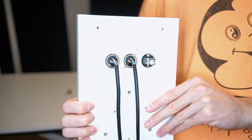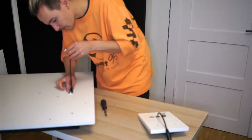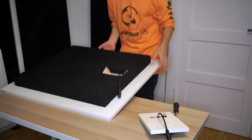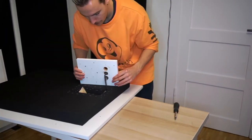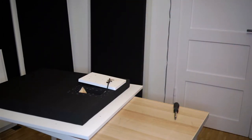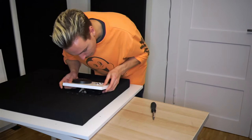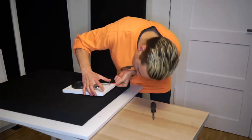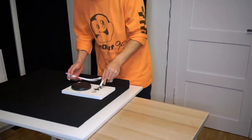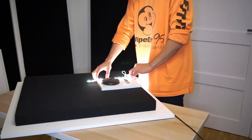I've attached the wires for the microphone jack and the headphone jack, and swapped them over to go in the top panel. The small panel is essentially a module which can disconnect from the top. Since the USB jacks have a jack on the other side, I just need a simple USB cable to connect between them — no soldering needed. Then I have some cheap LED strips from Ikea, stuck on with adhesive and powered through the USB port.